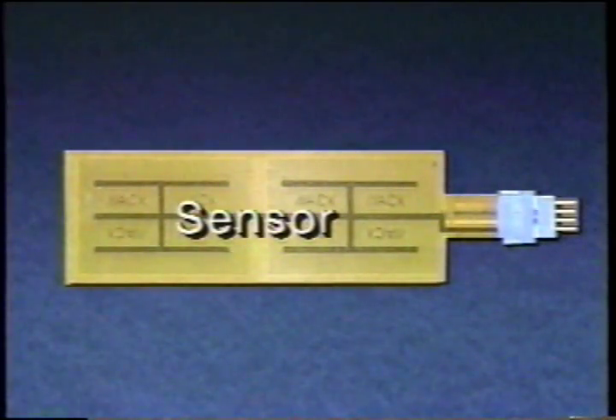Finally, I'm going to show you how ACX has applied piezoelectric technology as a sensor. This is a paper-thin load cell we designed that when you squeeze here, a voltage comes out there, and that voltage is proportional to how hard I squeeze. That allows you to take sensor measurements that are accurate and repeatable in places where traditional technologies just don't fit. We've designed custom devices like this for a number of applications, including a non-invasive blood pressure monitoring system for a medical products company.